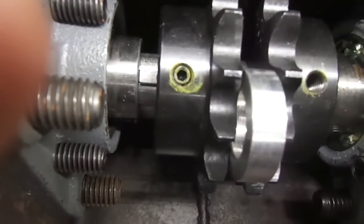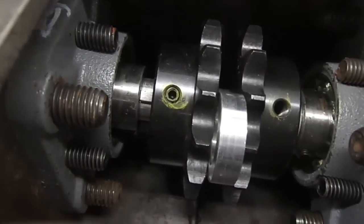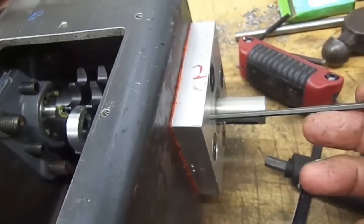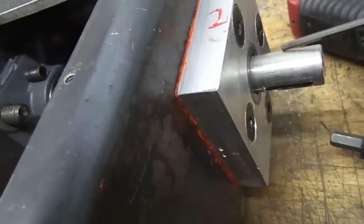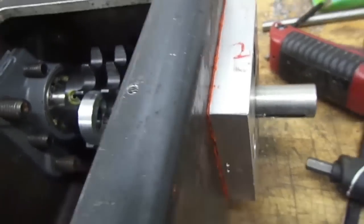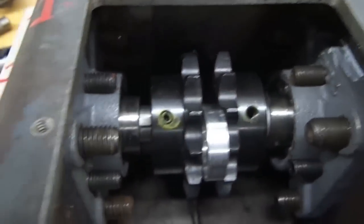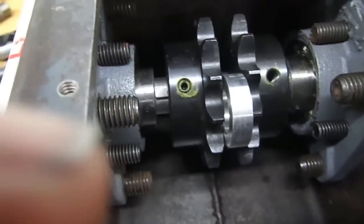Nothing, zero, zilch. That's why once this gearbox ever has a problem with the gears or the chain, whatever, I'm trashing this whole box here. I'm gonna build another one. Won't use these pillar bearings, but I'll do the same principle I did here, but I insert it and put the bearing inside of this piece, same way with a seal in it. And I'll put some dowel pins in it where it'll line up, then put these 4 screws fastened on there, on the next one. This is probably going to be a 4x4, and there'll be enough room because you won't have these pillar bearings there or there in the way. You won't have all these stupid screws. This is a joke here. I never made one, so that's the way I made it. I know next time you learn from your mistakes.